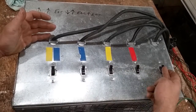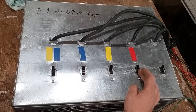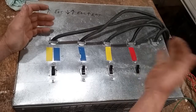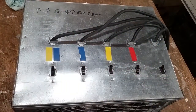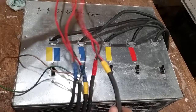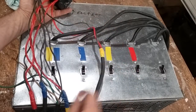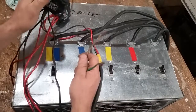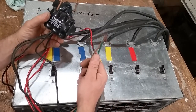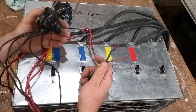There are four steps on this — this is a fan. Each one of these steps is a 20-amp two-pole switch, just a standard house switch but it's 20-amp two-pole. Each lead is color-coded and the other end of the lead is a matching color — like the yellow switch goes to the yellow lead and so on and so forth. Since the fans are 110 volts instead of 220 volt fans, I've got a neutral and a safety ground lead that I tie into typically the transfer switch box.